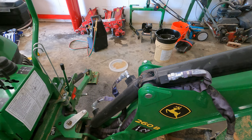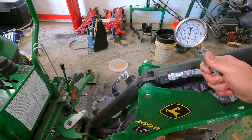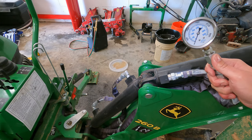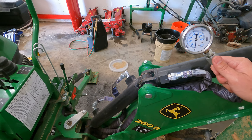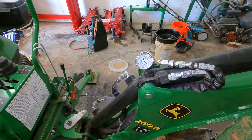I'm making some assumptions that the pressure relief valve on the backhoe is more than what I've got mine set at, which is around 2100 to 2200 PSI. If it is, I'm going to increase the pressure. While running, about 400 PSI per one full turn. I only have one pressure gauge, so I'm not going to set it to a specific spec — just going to put it up there temporarily.